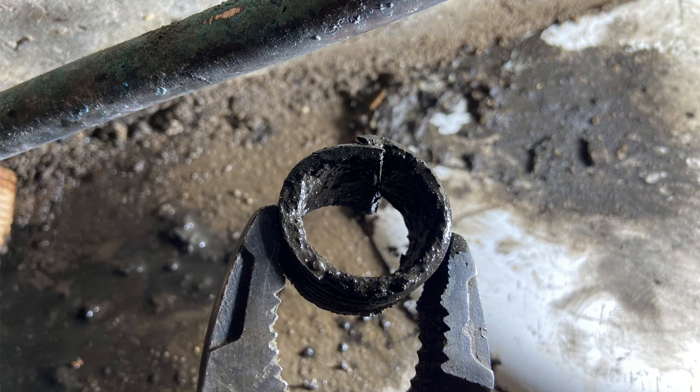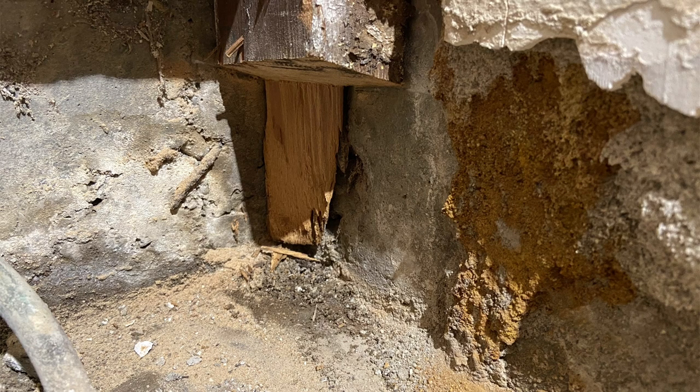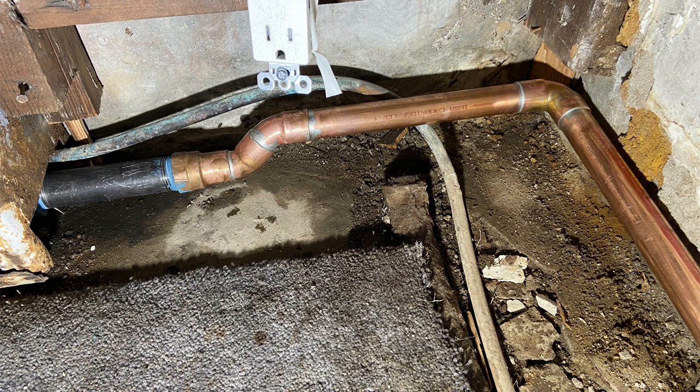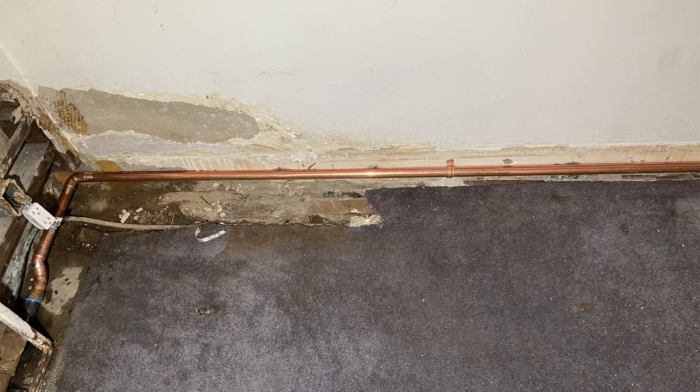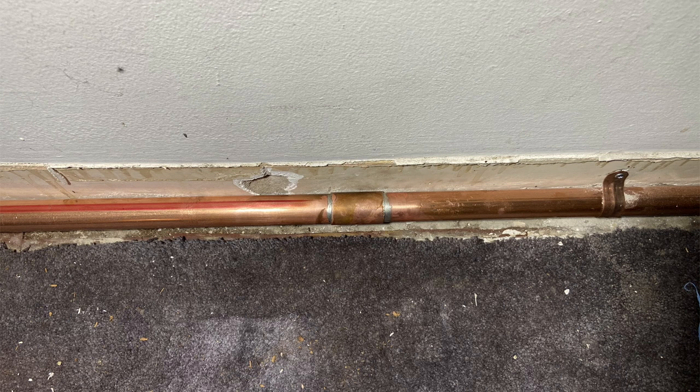It was time to put everything back together again. I also wanted to cut out some wood in the corner because I was going to be in there with a torch and I didn't feel like torching this lady's house. You could see all the dampness — the steam was starting to destroy the plaster and everything else. I put a nipple in the tee — the only reason was I needed something I could grab onto to tighten everything up. There was no way I'd ordinarily use a male adapter and make everything copper, but that's what I did. I got this in and then ran my first 10-foot piece along the wall. I put it where the handyman wanted it — he gave me a reference on where to hang it because he's going to box that in. Then I tied my next 10-foot piece in with a coupling, which got me into the boiler room.